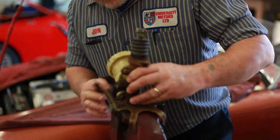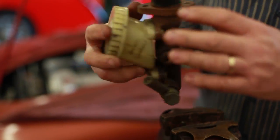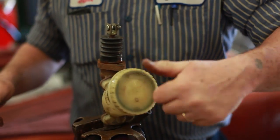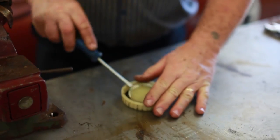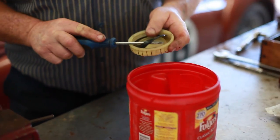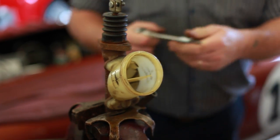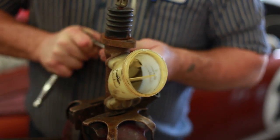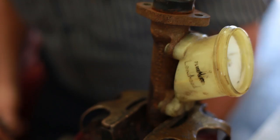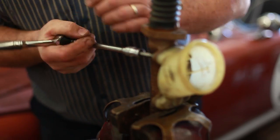So we've got our nice vice here. We've got these four screws and I've got to get these four screws out. We're going to take off the cap, start there. The cap comes apart — we'll pop him apart like that. Here's all our junk going into a basket. We're going to go wash this after a while and it'll come out nice and clean. So now we've got to get the reservoir off, so we have to use the number three Phillips. I've got that and of course we drop the screw, but that's okay because I have three more to get out.